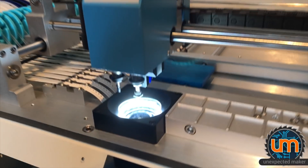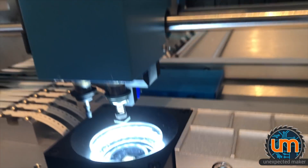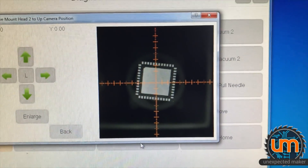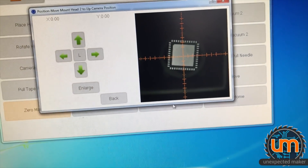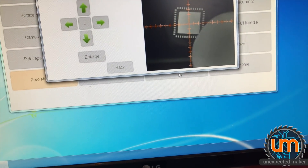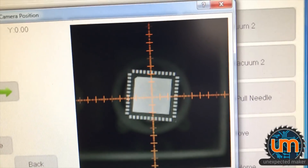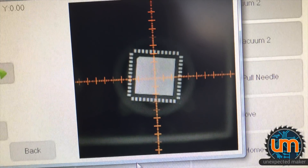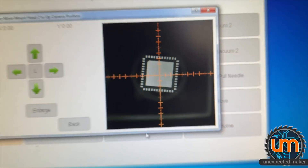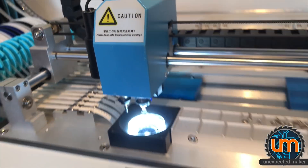Before I start, here's the head sitting over the camera with a Pico D4 on it. The vacuum is running and you can see over here I've got live vision of what I see underneath — if I put my finger under the camera you can see my finger go in. I need to now focus this, because it's a little bit out of focus. The more focus I can give it, the better the image detection will be — so here we go.